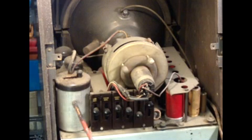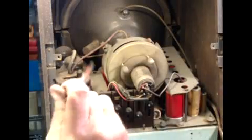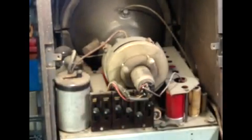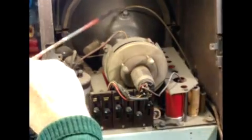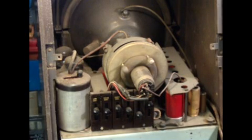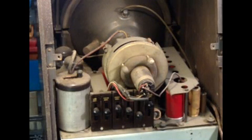On the left here you've got the line output stage, which scans the picture from side to side. There's a vertical timebase stage over the back here that scans the picture vertically. The high voltage is fed in on the tube here. The tube is an MW227, which is a Mullard Phillips Continental — called Mullard in the UK. And that's basically the D16T.